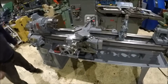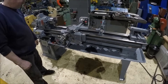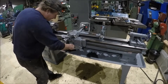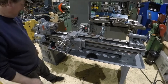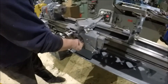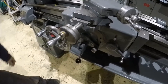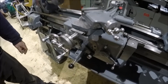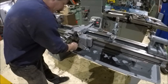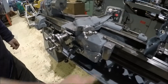Starting the machine up here to run it. This is going to be the cross feed — put it down, it's cross feed. This handle here disengages it. This is the threading handle — you've got to have it in the center position here for the threading handle to engage. That's for threading. It's got the thread dial on it here.